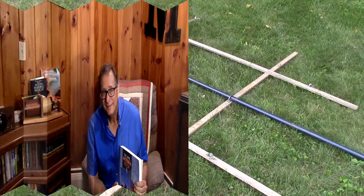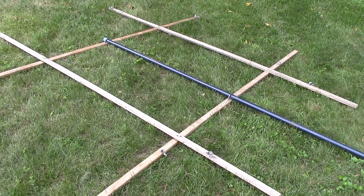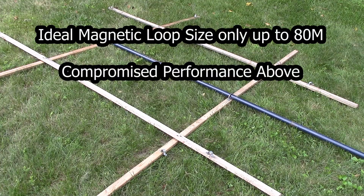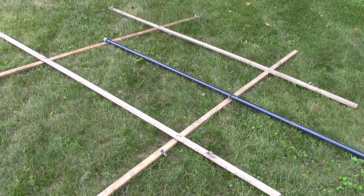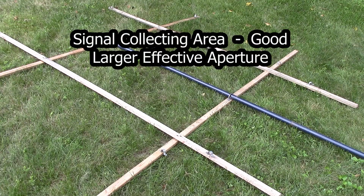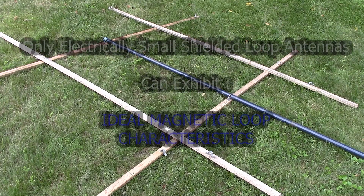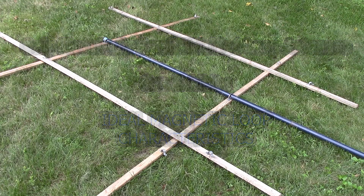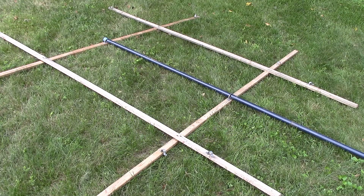It's a deliberate attempt to build a poorly functioning loop, and that's where we're going to start, and we will build from there. I'm now laying out a loop antenna that would be effective from the VLF frequencies up through the point where the loop begins to become resonant. All loop antennas smaller than their resonant frequency, or a full wavelength of wire around the circumference, are known as small loop antennas. They are electrically small, and the radiation will be in a figure-eight pattern, not broadside as with a quad antenna, but off the ends in a donut shape.